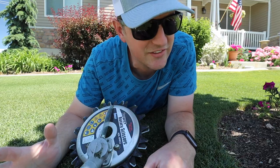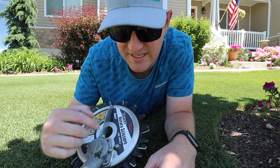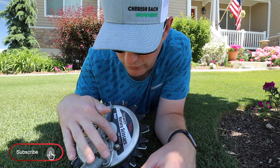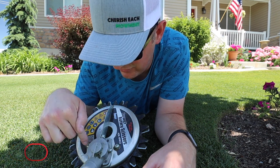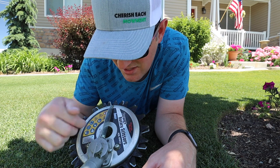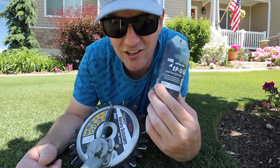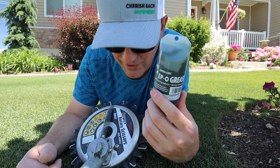Now, as far as maintenance goes, there are just a couple of things that you need to keep in mind with these. There are two points to grease the unit. There's two hex screws here and here, and then they call for EP0 grease, which I use here, and I'll leave a link in the description for this as well.